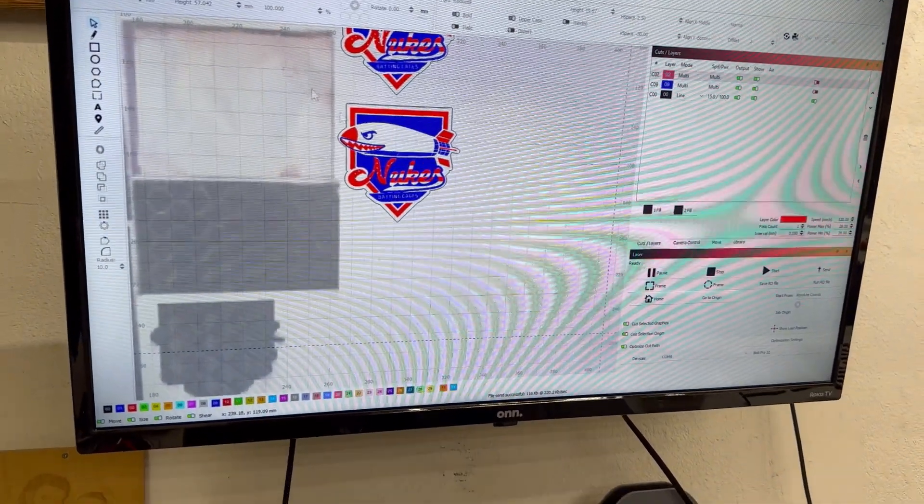Before I touched a real design, I started with a bunch of material test grids in Lightburn. This is crucial when working with any new material, and with Tri-Layer Acrylic it's even more important. I had to figure out what colors get revealed at different power levels so I can design my patches accordingly. This was honestly a shot in the dark at first because I'd never used this material before and didn't know how the Bolt Pro 32 would respond. So I did what most of us do — I hit up YouTube. I found a lot of helpful info from Emily over at Wild Willow, Robert from Computer Creations, and Gord from Lasernug. I'll link them in the description. They each had solid tips and starting points, but I still had plenty of testing to do on my end because of my specific machine.